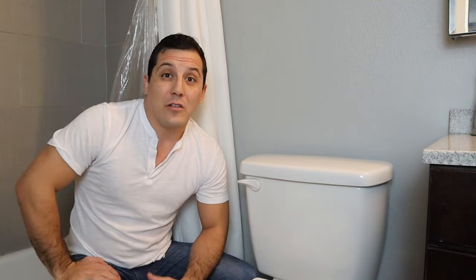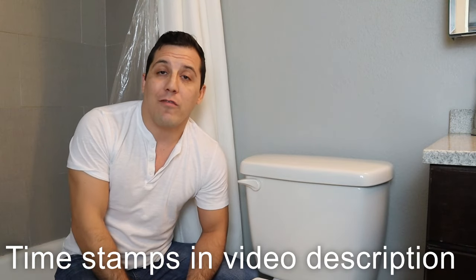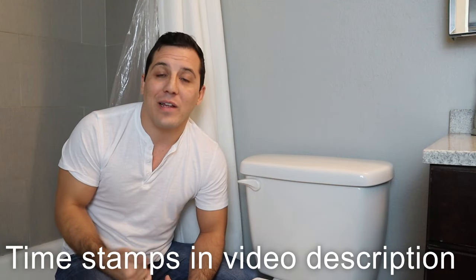I mentioned we're going to use a wax ring, but we're actually going to be using this wax ring alternative by Fluidmaster. I like to use this over wax rings just from a cleanliness standpoint, ease, and it's a really secure alternative to traditional wax rings. I highly recommend looking into a product like this Fluidmaster, which you can pick up at Lowe's or Home Depot. It comes with the bolts inside, so other than a wrench we really don't need much outside of this and our caulking to do a quick remove and reset of a toilet.